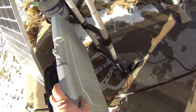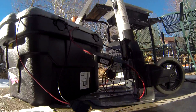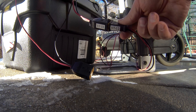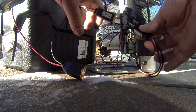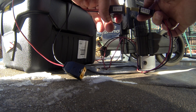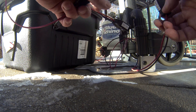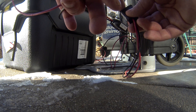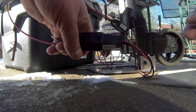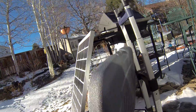If we come back here you'll notice there are cords hanging out, but those can all be tucked away — I just left them out so they'd be easier to see. Right here is a standard wall outlet type of configuration, polarized with a larger and smaller blade so you can't put it in the wrong way. What I just unplugged was the charge controller that recharges the battery. This goes directly to the solar panel, and this goes to the grid tie inverter. When I plug this in, I'm taking power directly from the solar panel and putting it into the grid tie inverter.